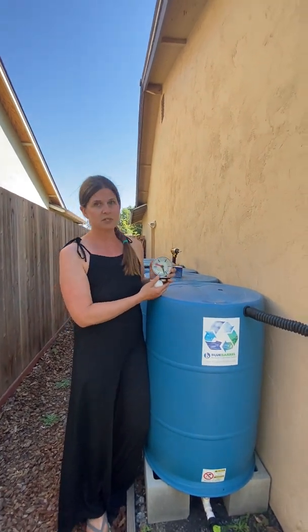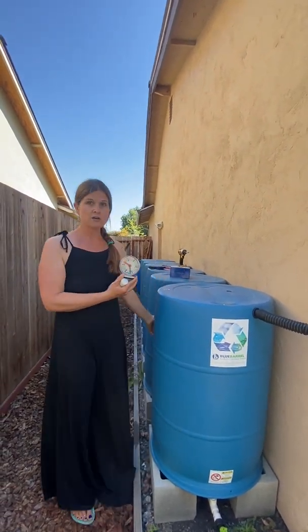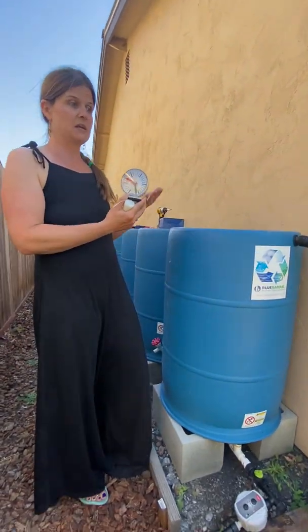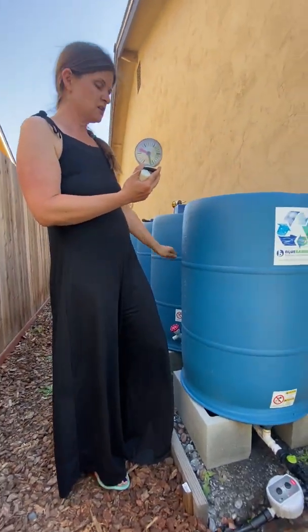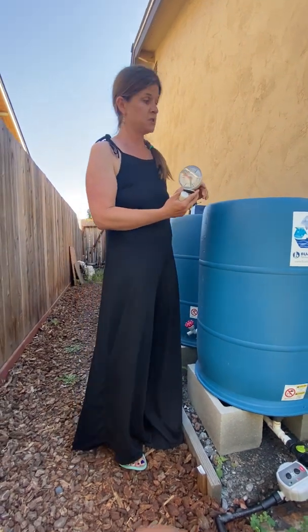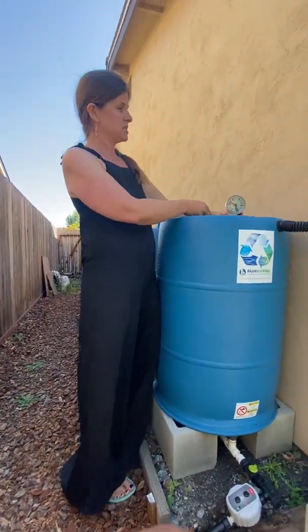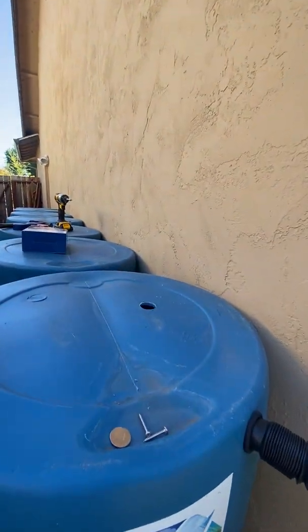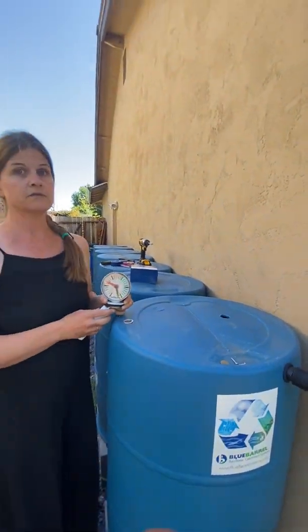So that's what we're trying to accomplish here. With the underplumbing, all of your barrels are always going to equalize and they'll have the same level, unless you try to control the water level with valves, which you can do. But for a basic setup, you just need one tank gauge on the whole system, and you're going to get an accurate measurement for the water level in all of your barrels.